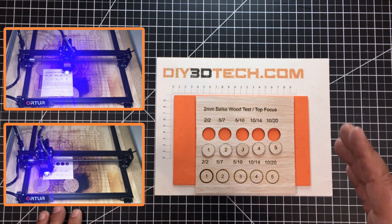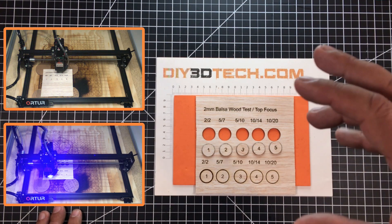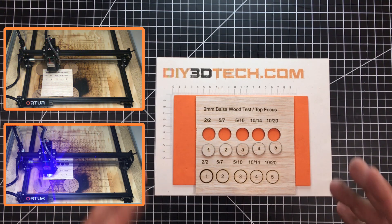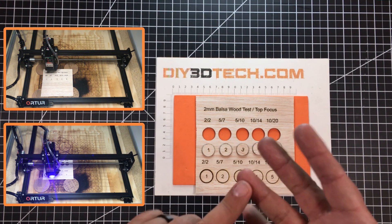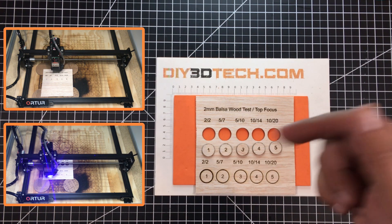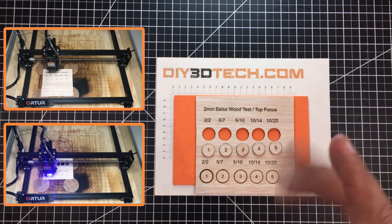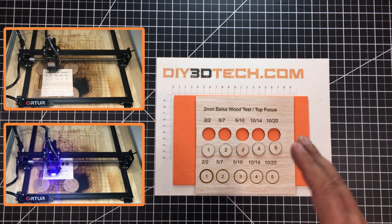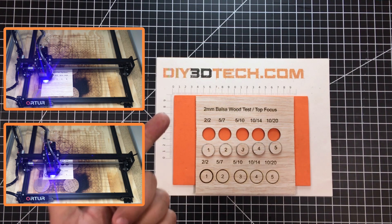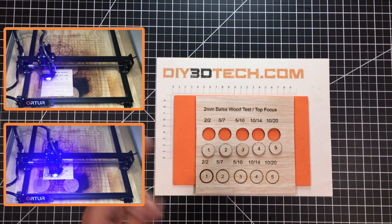There are different modalities of air assist. A lot of laser heads coming out take the fan and duct the air through the laser head — that's good for clearing out fumes, but it doesn't clear out the kerf and it's not that great for snuffing out fires. What I do instead — and I have a link below — is use designs for air assist where I pump about 6 PSI directly into the cut. By doing that, it accomplishes all three things: gets fumes out of the way, clears the kerf of debris, and prevents fires.